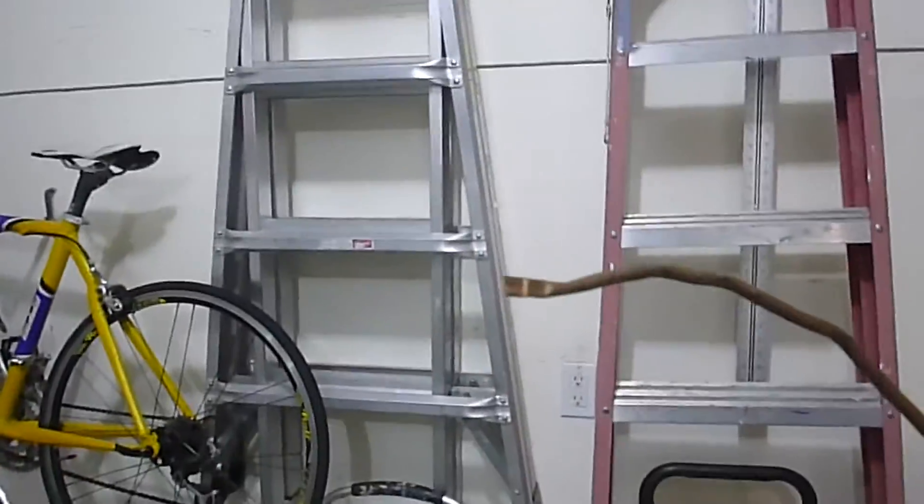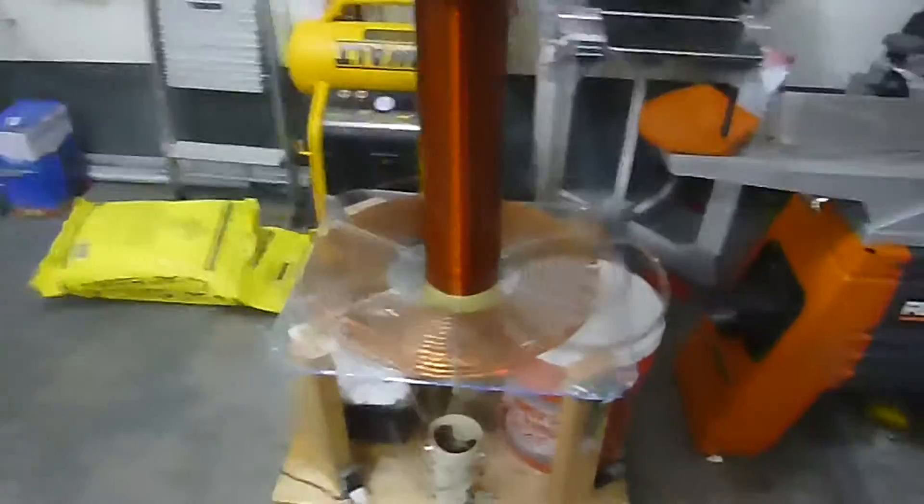And even longer to coat with some polyurethane varnish. The bottom end of this actually just connects directly to ground, which is back here. You can see there's the cable that connects to the bottom end of that. It spirals all the way up — it's around 800 turns. It connects to the toroid with some aluminum tape. The toroid is just some aluminum ducting with a copper rod sticking out of the top to act as a breakout point. This setup seems to work pretty well — I'm pretty happy with it.